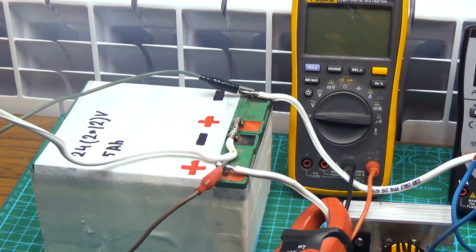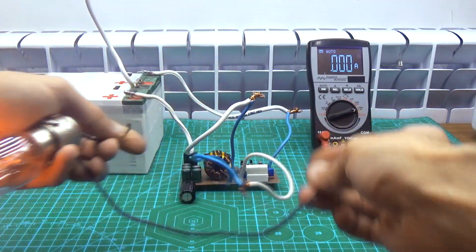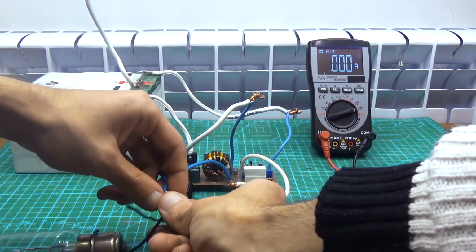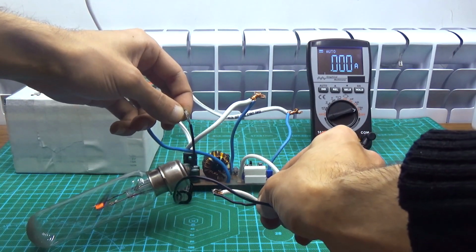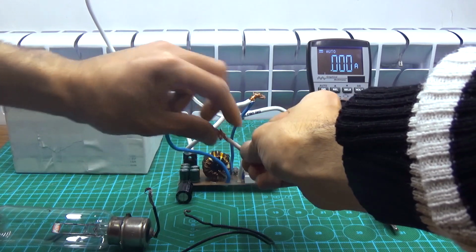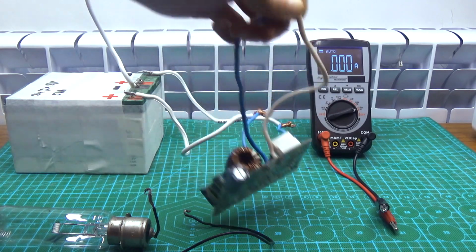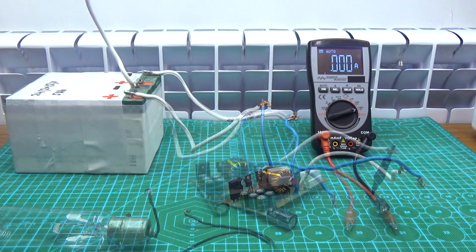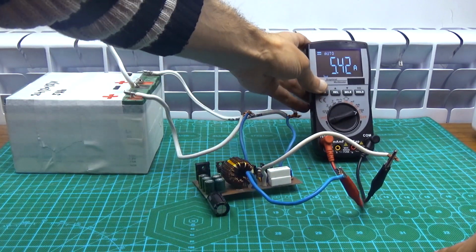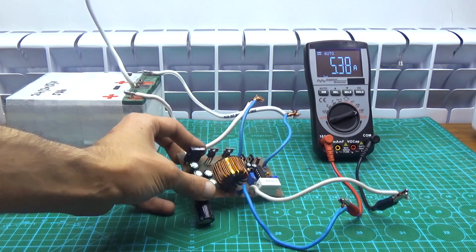At the input 24 volts is fed from the batteries. If the circuit doesn't work perfectly well, then everything will burn to hell, because the battery current is very big and not limited. Not bad, right? Now I set a current limit of 5 amperes and close the output of the circuit through the ammeter. Let's wait for some time and measure the heat dissipation on the power components.